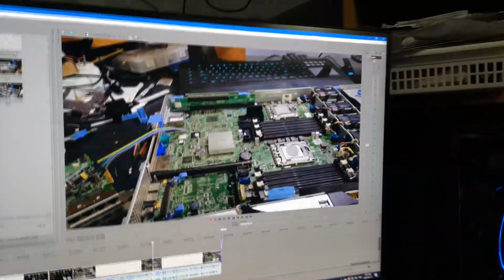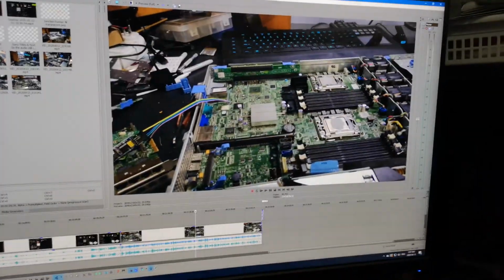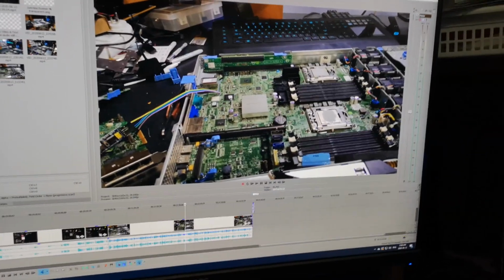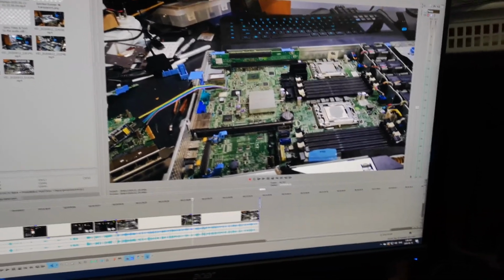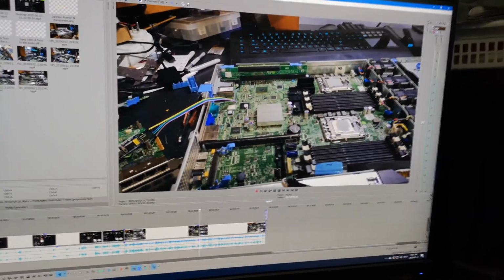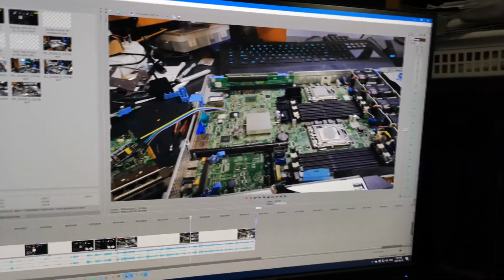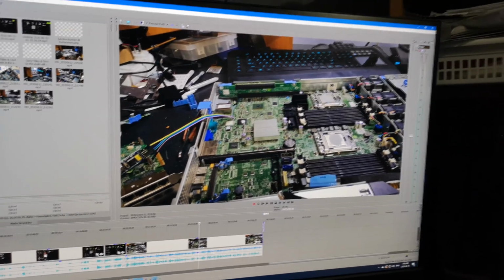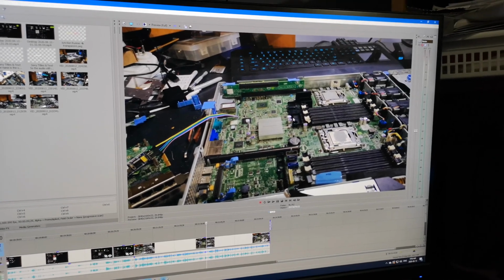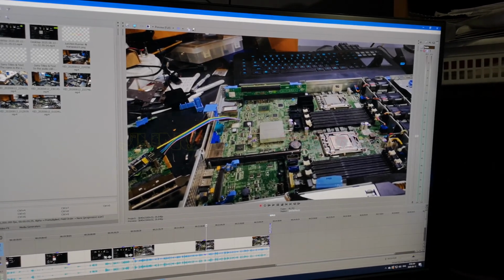So the problem is the boot time would still be really long. The boot time on the server is like super slow because it tries to boot IDRAC a bunch of times, which is definitely not ideal, especially if it was like your router. But you could wire an Arduino in there and deadbug it into place and set it so that the Arduino basically jumpers that switch, then hits the key, puts in a command to lower the fan speed, and then, every time the server turns on, it just does that. So that's a potential option. I don't know, actually thinking about it, if it reboots again and tries to start IDRAC, I don't know if it would have to do that every single time, but yeah, we'll see.